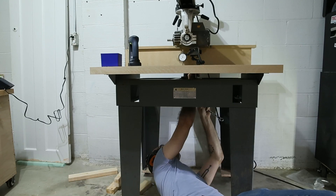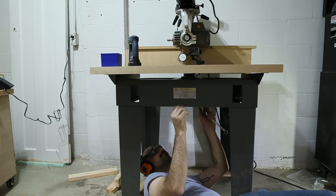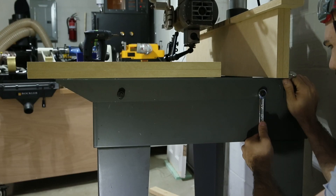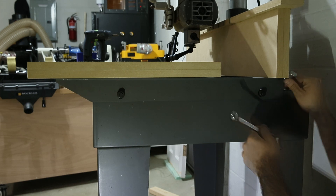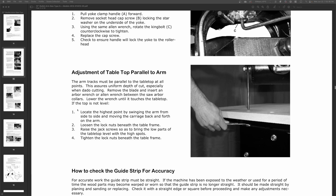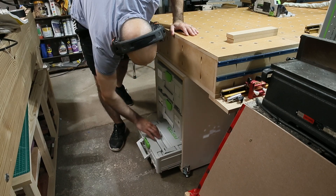Now that the front table was attached I needed to bring it parallel to the arm, roller head, and yoke. This is known as tramming it in. The table can be coarsely adjusted by loosening the lock nuts that hold it to the frame but there's no mechanism for fine adjustment. I guess they expected that with all the lead and asbestos floating around you would have grown a third hand. On newer saws they added jack screws on each of the four corners that make this process possible, or at least sane.